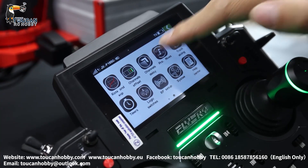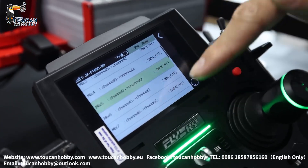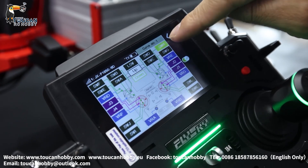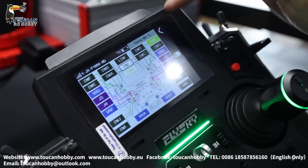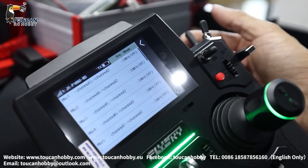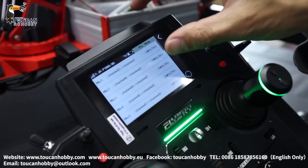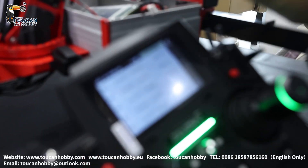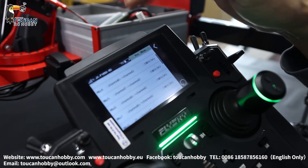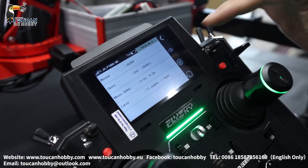Go to Pro Mix and click — there are seven mix controls for each function. Click mix 1 and click the switch. We are setting the switch on the mix control with SWH — this switch. After switching it on, all the mixes are now on. Channel 2 is the pump. For the mix control operation, channels 3, 4, 5, 6, 7, 8, and 9 are the master, and channel 2 is the slave.